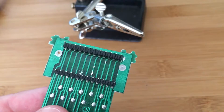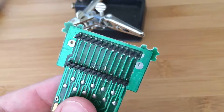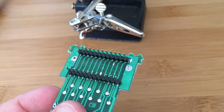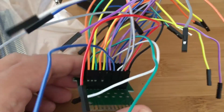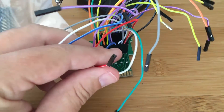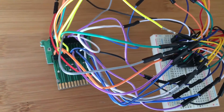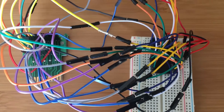Okay so this is where we're at. I just put some headers where that ROM chip was. You could put a socket on here, or maybe even a zero insertion force socket. But I don't have any, and I couldn't just slot the ROM chip in there either because it's the wrong number of pins. So to make this dodgy project a little more dodgy, I'm using headers. I've added some wires, and now I'm going to plug even more wires from these into the breadboard. So now we have the Atari cartridge wired up to this 64K ROM — and this is really error prone.